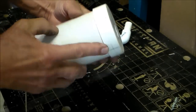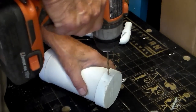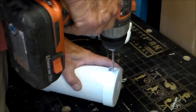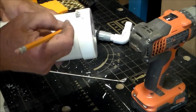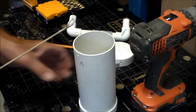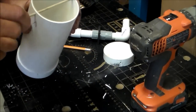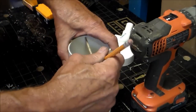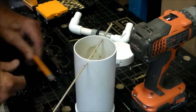I'm making a cap onto this unit so that sunlight won't get in and cause algae to grow. This hole will be where the fiberglass rod will be inserted. When I finish with the cap it will be a twist lock. Reference the two halves so that it can be returned to the original position. Insert the fiberglass rod as far as you can and wedge it in. Mark reference lines about a quarter inch out — this is going to be the tabs that will lock the cap on.